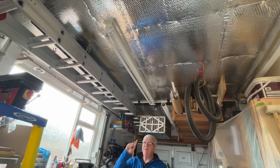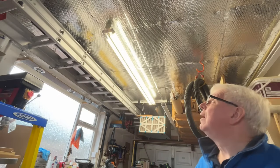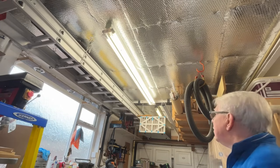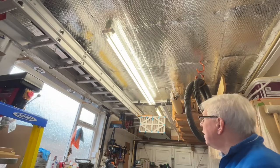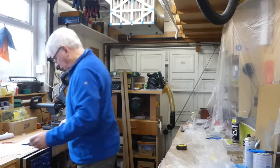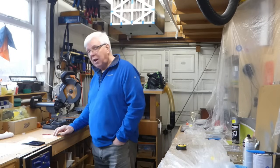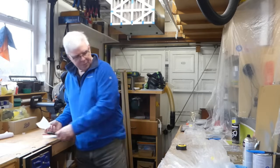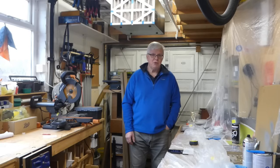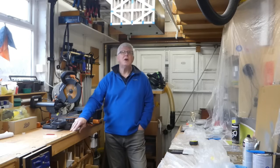We've got the two tubes fitted and both LED starters fitted. Let's put the lights on. It certainly looks brighter and whiter than the old tubes. Let's do the test with the light meter app — putting the diffuser over and stepping back — 7700 lux. Just as a reminder, the old tube gave 8900 lux on this side. Over on the other side we're getting 4800 lux, compared to the original 6000 lux. So in both cases it's actually lower.